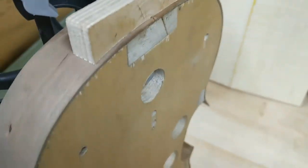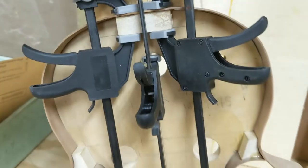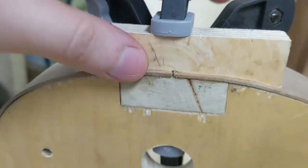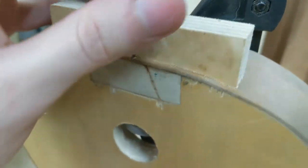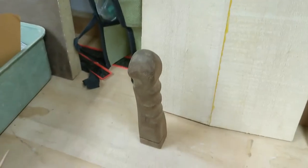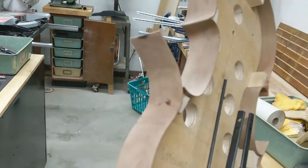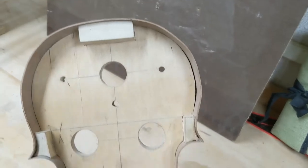We have this glued up on the bottom, however there's a slight gap - barely a millimeter - but I'm probably going to cut out a little of it and put in an insert, maybe cherry or some ipe. There's a weird clamping situation and because of that gap there's a lot of squeeze-out, and I'm worried the plywood piece will get glued to the sides. I'm going to take off the clamps, slide it out, clean it up, and clamp it back. Hopefully that works and we'll have almost the completed thing - just got to trim it down.